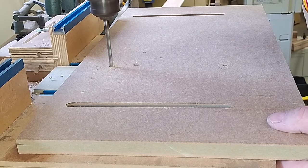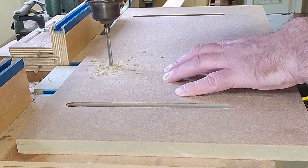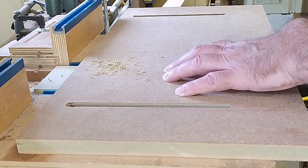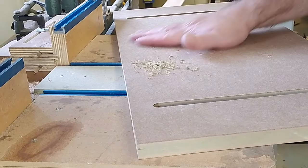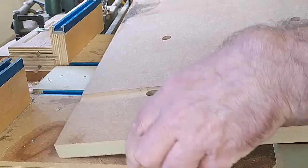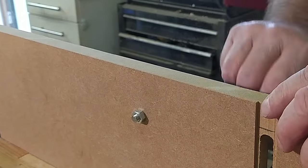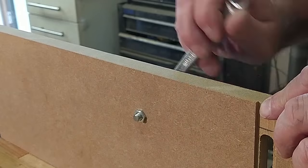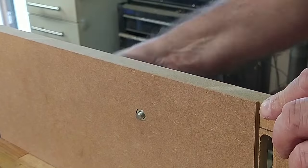On this jig I can mount the workpiece vertically if I want to — this is handy for floating tenon joinery. So I need two embedded nuts for this. Actually I'd marked these out from the wrong side, so I did it with four embedded nuts rather than two, but actually that was a fortuitous mistake. I can see now that there may well be times when I need to mount mirror image components in opposite positions. I've drilled 2mm holes right through to mark my positions, then 13mm on one side — deep enough for an M8 nut — and right through at 8mm for the Bristol lever.